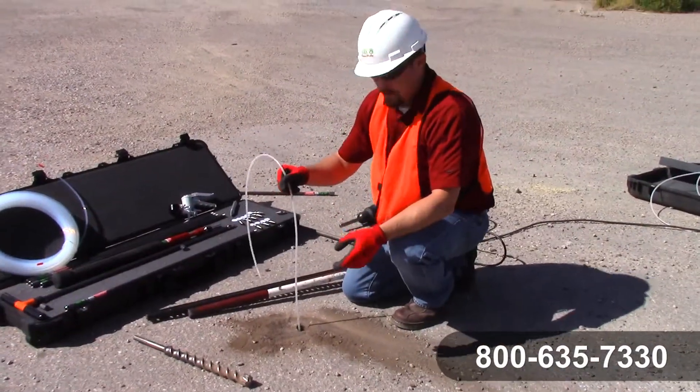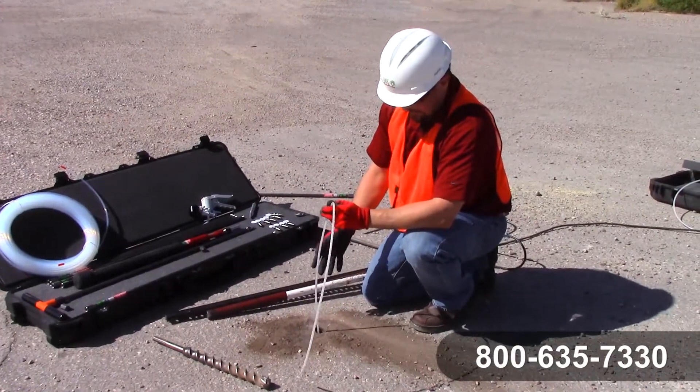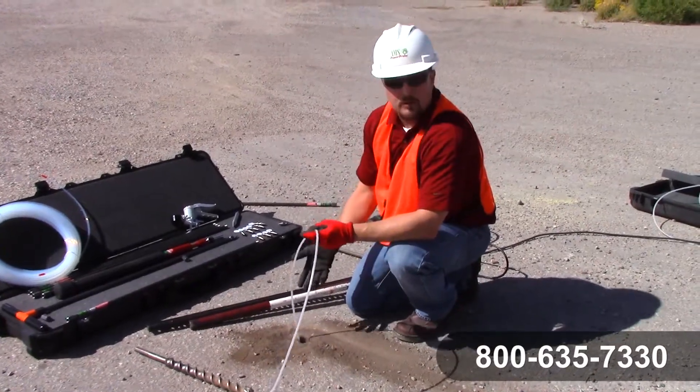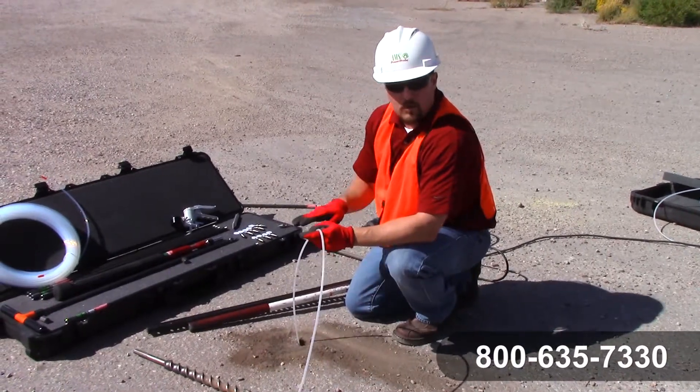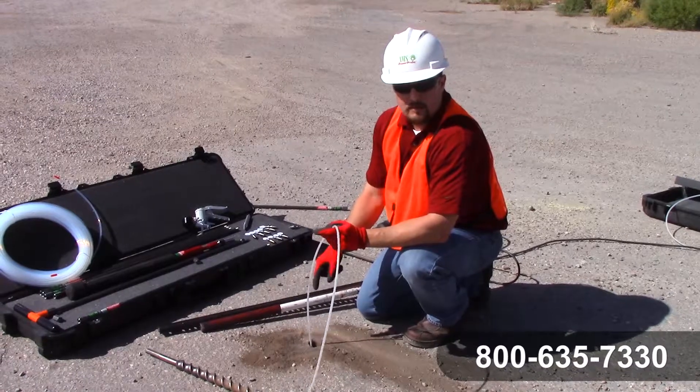Now that we've got that point set, from here at the surface you can put in a well vault and backfill with sand and a bentonite pack, hydrate it, and then grout it in towards the surface and come back and sample periodically at this soil gas point.